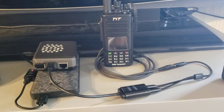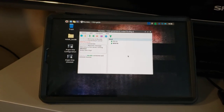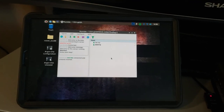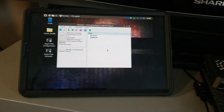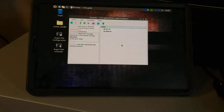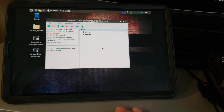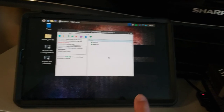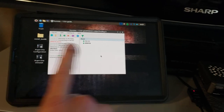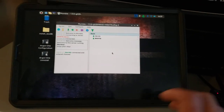Radio is turned on, and over here you can see I'm feeding into my Raspberry Pi. This is Mumble — Mumble is my radio server handling my radio traffic up into the server running on the Raspberry Pi and then out through the radio, and vice versa. The client is handling voice traffic coming in and out — either receiving from the radio and pushing it up to the server, or receiving from another client on the server and pushing it out through the radio.